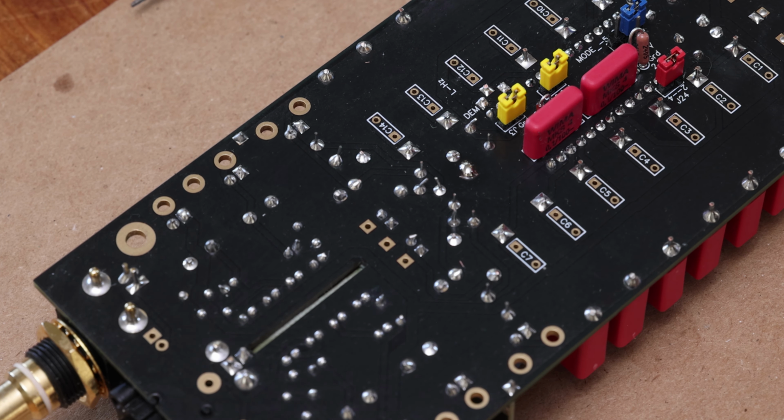Make sure your power supply does not have the negative grounded, especially if you have a 3-prong plug. If you check the ground of the cable and the negative of your power supply, you should not hear a beep. I had one fellow who was using an i-Fi power adapter, but he was using the Elite, a very expensive one, and I guess it comes with a 3-prong wire, and the ground is tied to the negative of the power supply. And that's not on the regular i-Fi. They're just 2 prongs, and the negative is not connected in any way to the ground. But for some rare power supplies, if that is the case, you're going to have a problem.